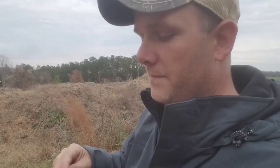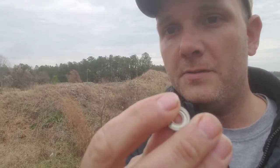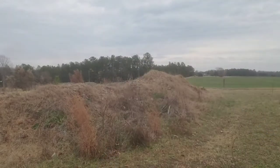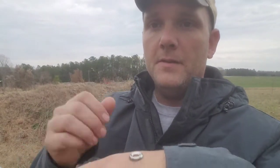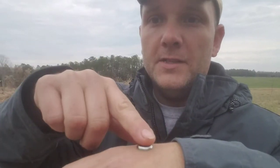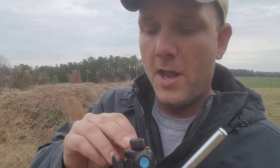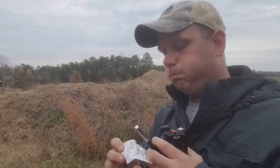What's the point then? You know what that is — you carpenters, metal workers, leather workers? This is a finishing washer. It goes on something, you can put a screw in it, and the screw sits nice and flush. It's a nice little round, pretty little thing. Just go to the hardware store and say, can I have a number 10 finishing washer, please?